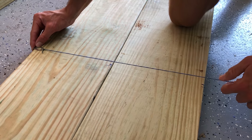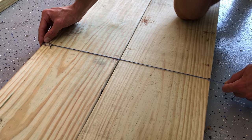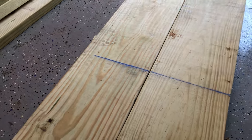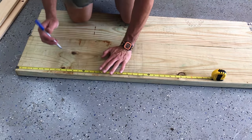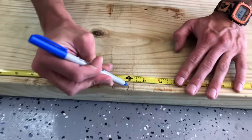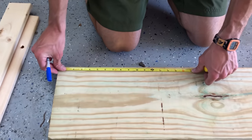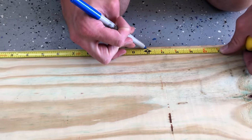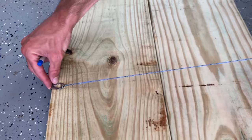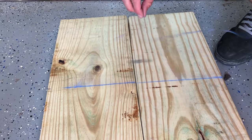So I want to make this a little bit differently. For the sides and the top surface of this ramp, I'm using these 2x10s which are pressure treated. And once they're stained, they'll withstand years and years of being outside. To start out, I'm just going to make some quick measurements on the 2x10s and then draw out the sides of the ramp. I'll be sure to draw up some blueprints and attach a link or photo in the description so you guys can follow along with the specific measurements if you decide to build this exact same ramp.